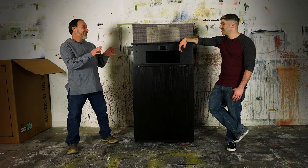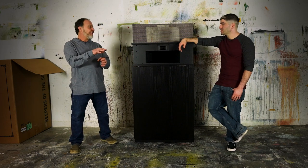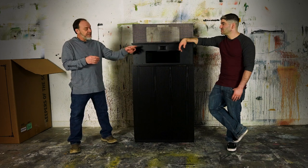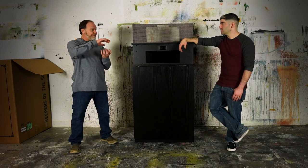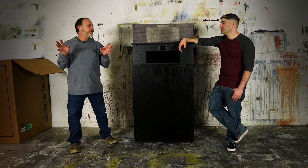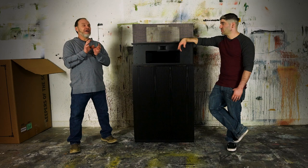You know, Dodge made a big deal about the Hemi engine, that rounded top inside the motor compression, to give you better compression or more room for combustion. That's extremely important, the shape of those heads, because it controls that stuff. The same thing happens with a compression driver. The shape in relation to the dome versus that phase plug and the slots or openings on that phase plug control completely how that phase plug squirts sound into the room, or how that speaker, that tweeter, squirts sound in the room. The higher you go in frequency, the more difficult it is to control.